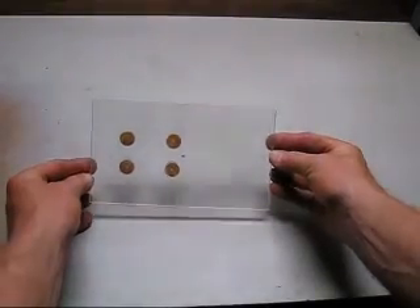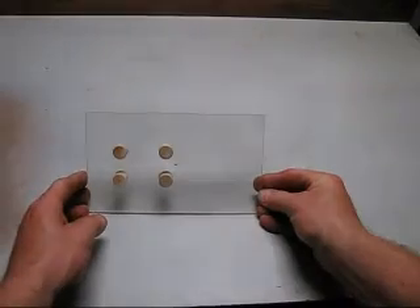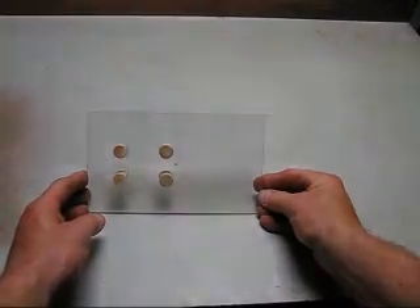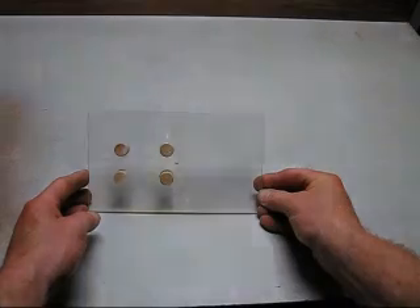It'll be cast in aluminium. You may ask why, because I normally do everything in iron. It's because there's a lot of overhang on the boom, and any extra weight when it's fully extended will tip the thing over. So I've got to make it out of aluminium.